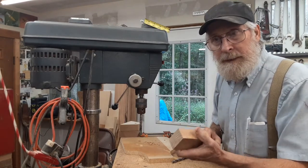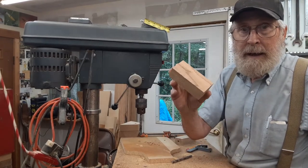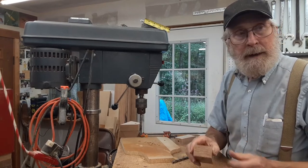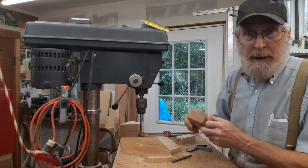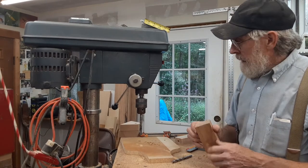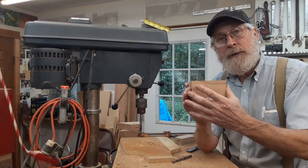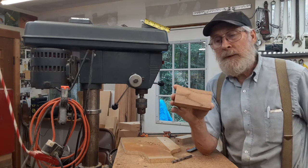Now here is the jaw piece — this is a jaw piece that I have roughed out. Yesterday, after I showed you those pieces of wood, I went through and sawed them out with a skill saw and a band saw, ran them through the jointer, through the planer, and through the drum sander. I just showed you how to saw the pivot piece, and I sawed this jaw piece at four and a half inches — that's three times the thickness of a two-by-four: three times one and a half equals four and a half.